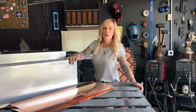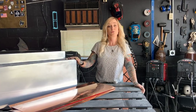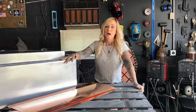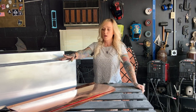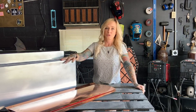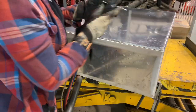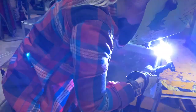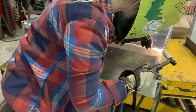Once I figured out how big I wanted the base — about three foot by three foot — and all the actual edges of it, I did do a bevel on them so I could get some solid penetration when doing these joints, because I knew I was going to be sanding them down. If I would have just butted these corners all together and welded on it, I would have been worried about cracking and stuff like that from sanding it down.